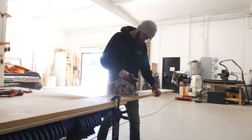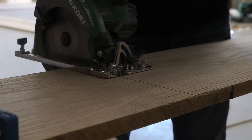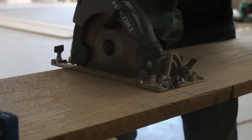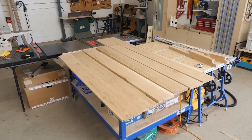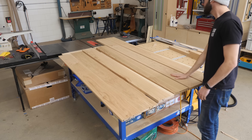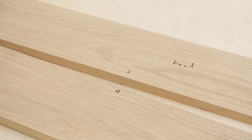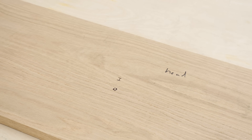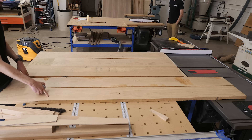Here I'm starting off with a bunch of white oak hardwood and just kind of breaking things down and figuring out where I'm going to get all my parts from. No finished cuts here — just making big oversized chunks with a circular saw and then labeling my pieces so I can keep track of what they're going to become. Thankfully with white oak, at least the boards I got, each one was pretty consistent in terms of look, so I didn't need to spend time figuring out grain matching.